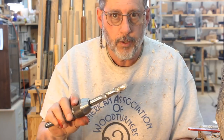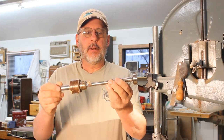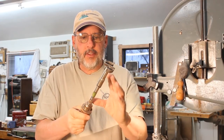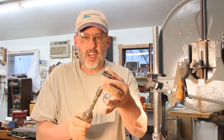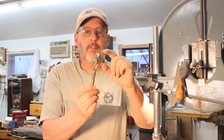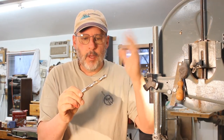As I was finishing up this video, it occurred to me that I missed a couple of drill bits. Here is one of my dedicated drill setups — it's a Forstner bit, a really nice drill. I've got this set up for some of my hollow forms; it's about an inch and an eighth. And what I'm holding up right now is a Brad Point bit. If you're an old woodworker you probably know Brad Point bits — they're an excellent woodworking drill bit. If you're new to woodturning it may be new to you, but it's an excellent bit. You can start with it and drill for depth or for various other reasons.